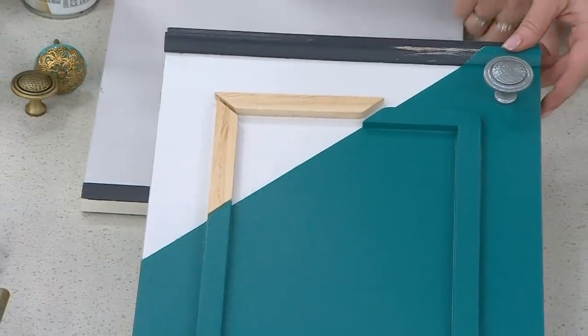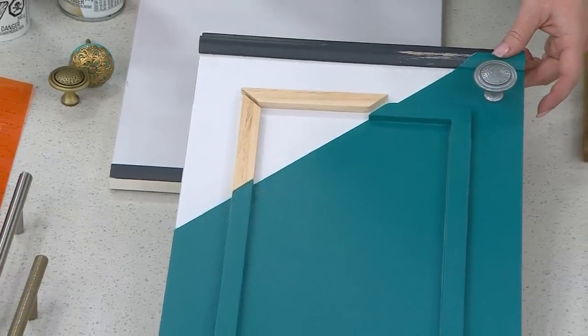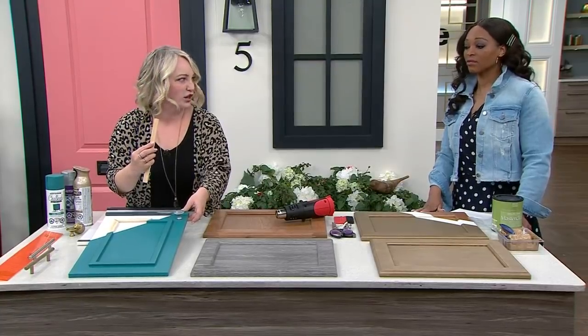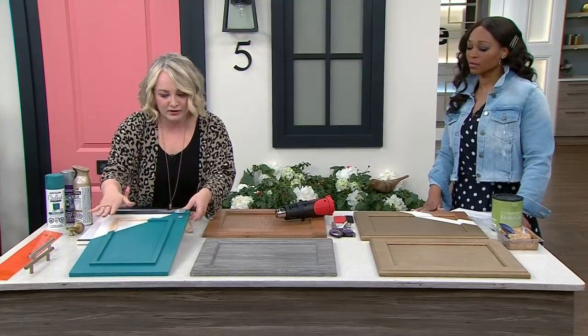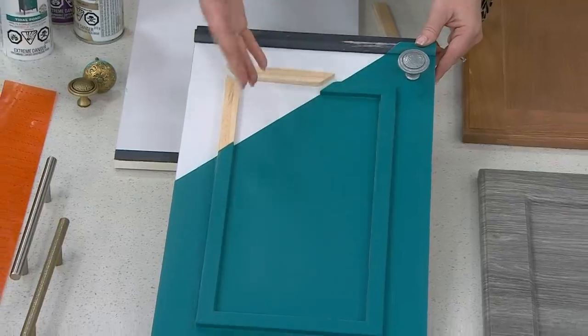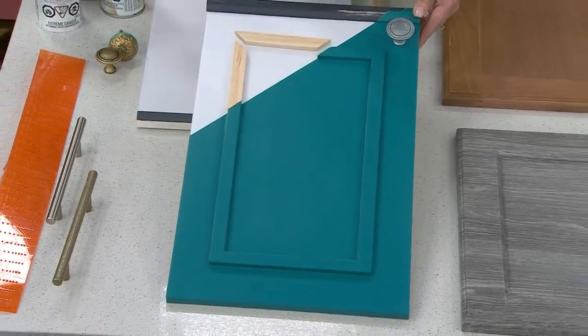That's nice. Really is all I did. You can buy long runs of the wood, even in detailed profiles. I just went with something very flat, like a shaker look. I applied it right onto the front, and when you paint everything out, it gives that molded door look. And again, painting out the handrail, adding the hardware.